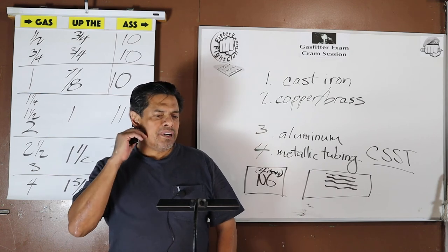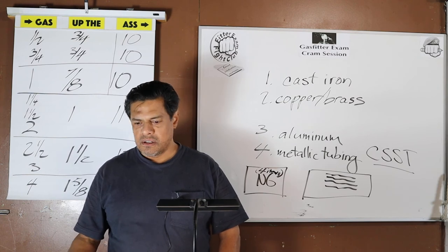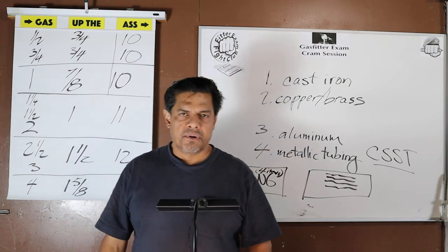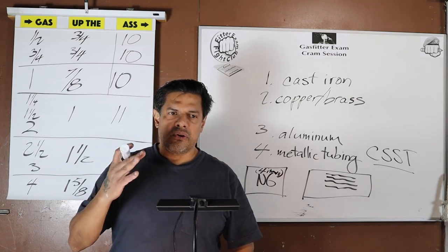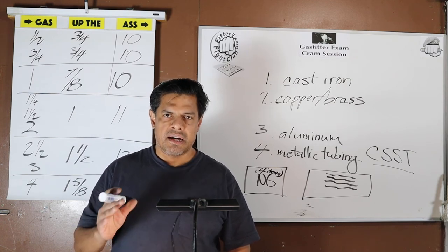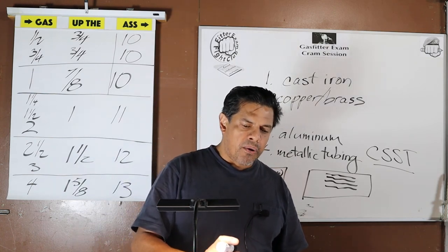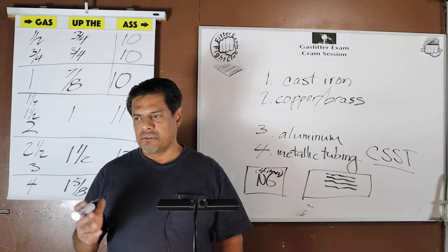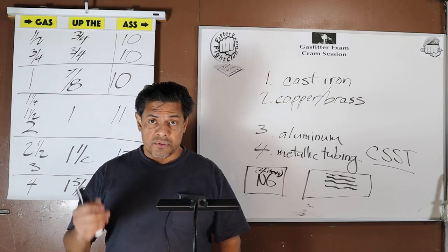This is not on the test, but since we're here, we might as well touch upon OSHA and safety. It's not safety first, it's safety always. So, blown out. How are we going to blow this out? Compressed air. We cannot use compressed air at a pressure higher than 30 psi. And although we can blow out the chip and scale, we do not clean ourselves. Although it's easy and convenient, OSHA says we do not clean ourselves with compressed air.